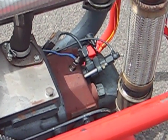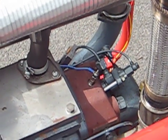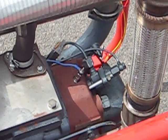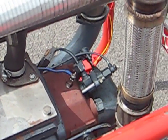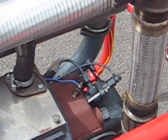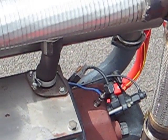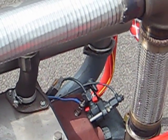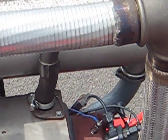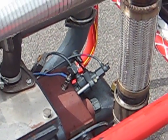You can see here the glow plug fitted. The glow plug is actually a custom-made glow plug. Most glow plugs are set to work at around about 11 volts, due to the fact that glow plugs are generally made in sets of four for the automotive industry, and four glow plugs together pull the voltage of the battery down significantly. This glow plug will run once the engine starts for approximately 30 seconds, and that's when the DC alternator is providing 13.8 volts, so this glow plug is specced to work at 14 volts.